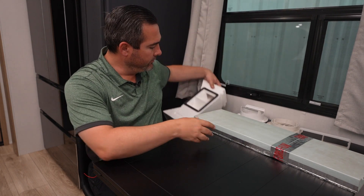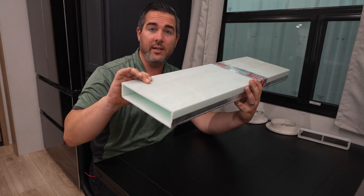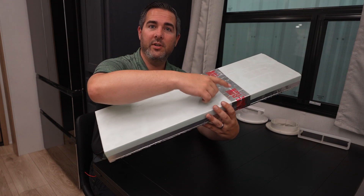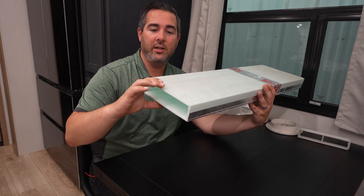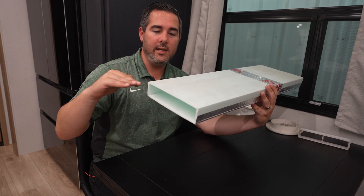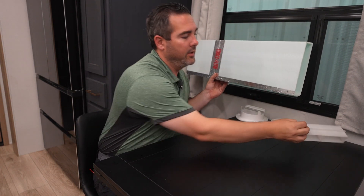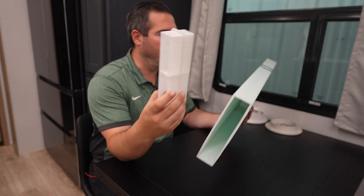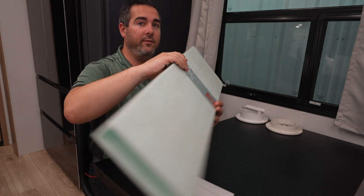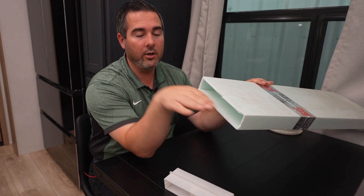When the air gets into the ducts, this is your traditional style ductwork inside your ceiling. Traditionally, these sections just get taped together, but there's nothing to make it a strong connection. They are pliable, so over time as the tape loosens and AC air goes through, it starts bouncing and coming apart. What we did is put a coupler at each connection — as you can see, it's a really strong connection that's not going to come loose over time. This is a great feature because without it, ducts start sagging and you lose AC efficiency.